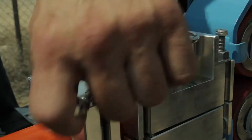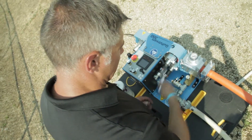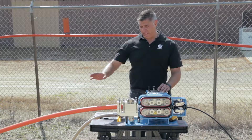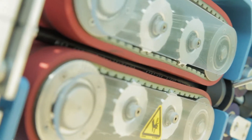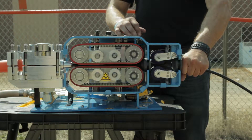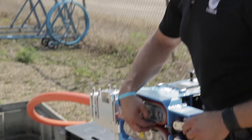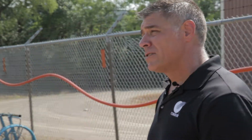When tightening the air block for crash testing, it doesn't have to be as tight as for installation — we're just keeping the Venturi in place. There are two things we're measuring: first, if we send the fiber down with too much down pressure or speed and it hits an obstruction, will it fold? Second, we're looking for slippage — we don't want the rollers continuing to spin and burn through the jacket while the cable is on an obstruction.